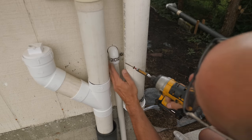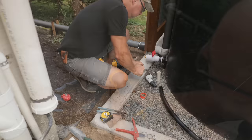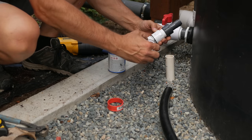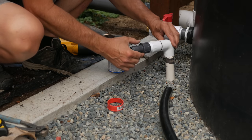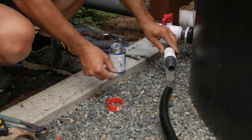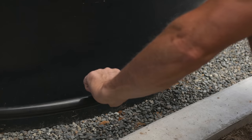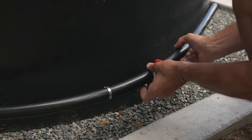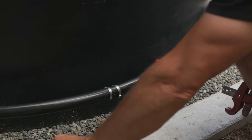It's tight in here — a galvanized strap will keep it secure for now. Where this line comes up through the pea gravel I'll add an elbow and barb fitting, then connect this to the ball valve at the bulkhead fitting with some flexible black poly pipe.